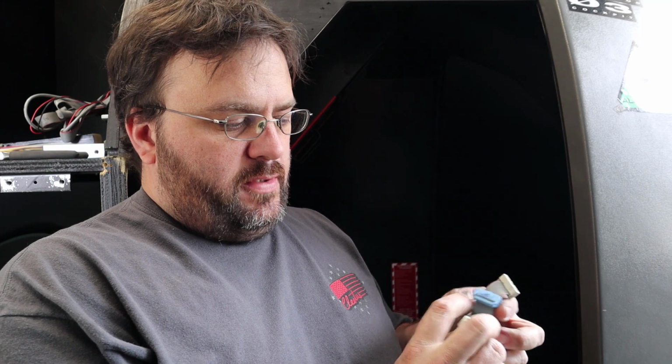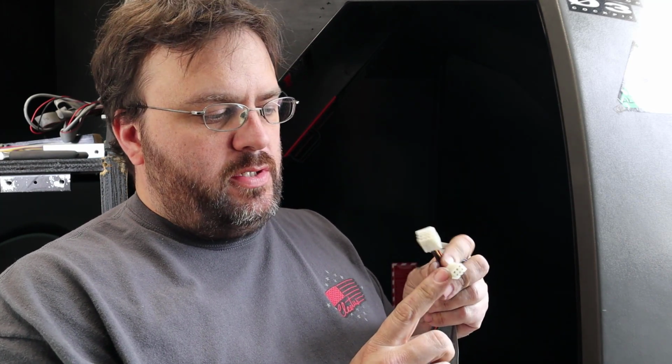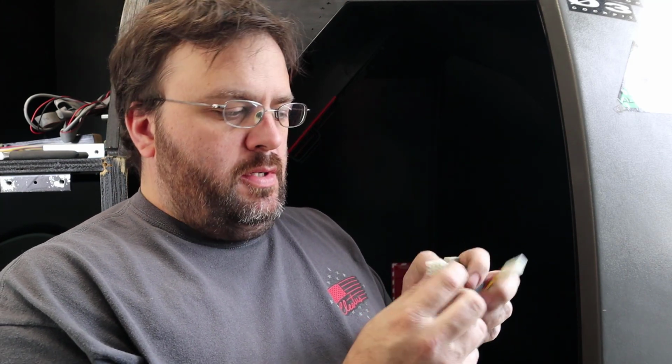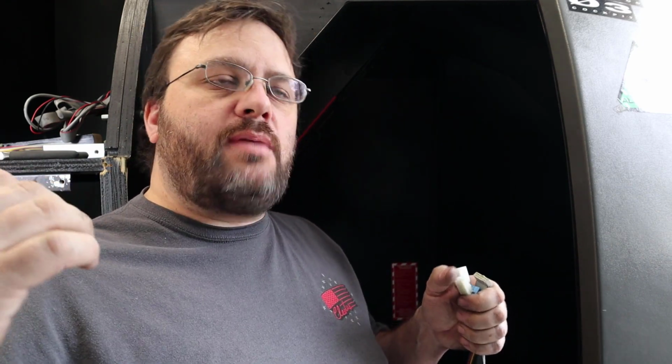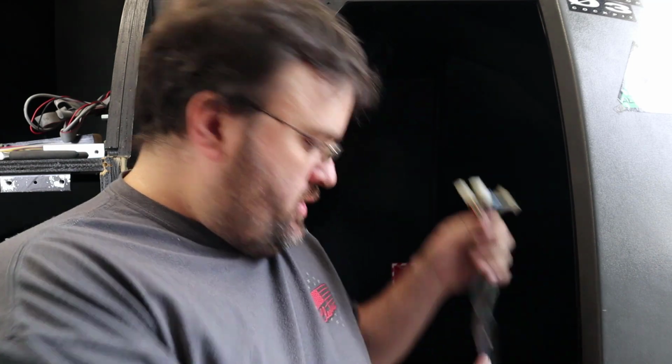The other 2 are for the optic encoders. You have these 2. The smaller one is the optic encoder for the throttle, because it has forward and backward. The joystick itself is twice as big because it has horizontal and vertical on the optic encoders. These 4 lines run underneath the pod entirely up to the tech bay. You have to drag them up from in there and attach everything together.